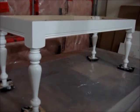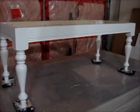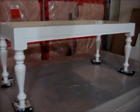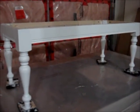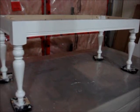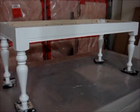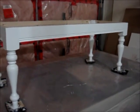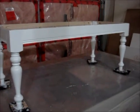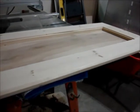I think it's going to look really sharp with the white and dark walnut on top. I just finished ordering my glass and it's going to take a couple of days, so I'm going to wait. It's a good idea to order the glass before you stain it — you never know if they cut it wrong or your measurements aren't 100% correct. That way the glass will fit in perfectly. I'll wait until the glass is in, test the fit, and then we'll be staining the top. I'm really happy and excited — just waiting for the finishing touches.